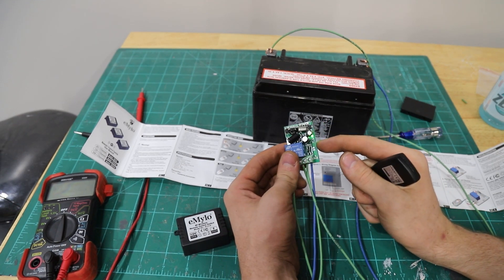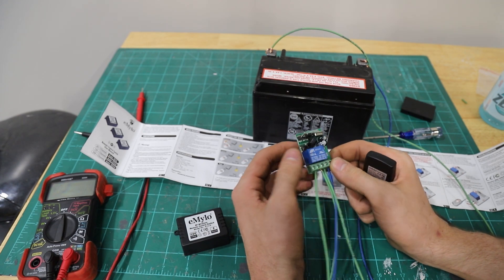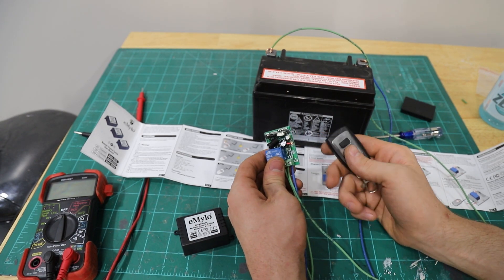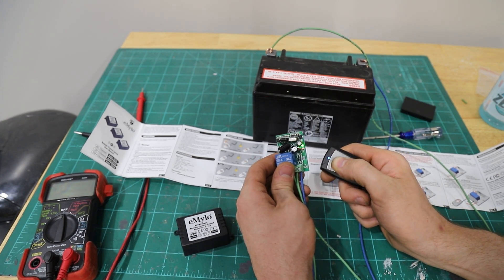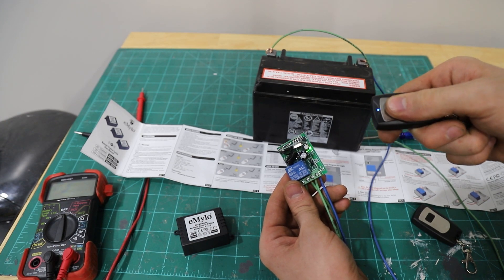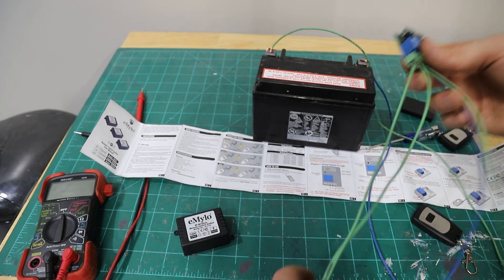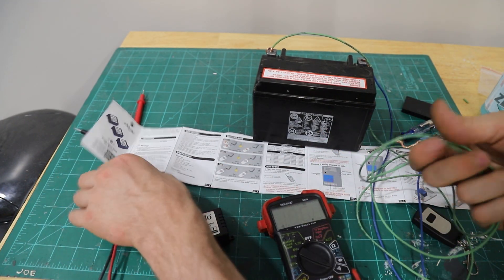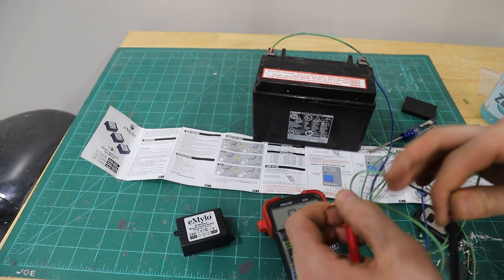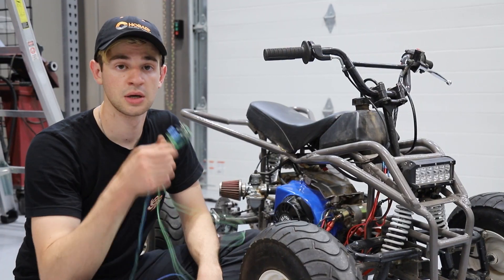Green-red means it's in jog mode. If you wanted latched mode you'd wait for green-red-green-red, but we're just letting it blink once. Hold down the programming button again to set it. Once it holds red, hold down the button on whichever remote you want to program — now that it flashed, it's working. Whenever the button is pressed these two wires are connected. To prove it, we'll put a multimeter on continuity and touch each end — press the button and we should hear a beep confirming the connection.